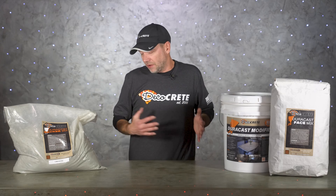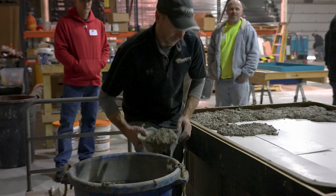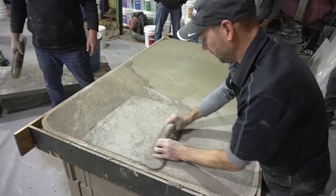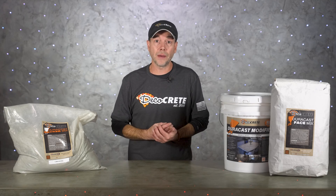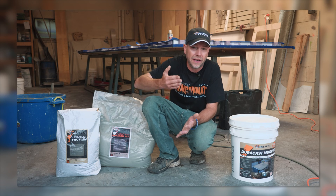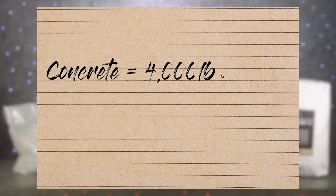The good thing is that downside can be completely overcome if you go about it the right way. The two most common mixes you'll find for countertops are a traditional wet cast mix or a GFRC mix. Wet cast is pretty much just like the stuff you pour every day — it might have a few tweaks for thickness, but it's basically just concrete. GFRC, on the other hand, is a whole different way of casting concrete countertops, and we do have a full how-to video for GFRC on our channel that goes through the entire thing from start to finish.